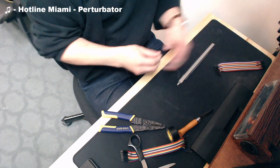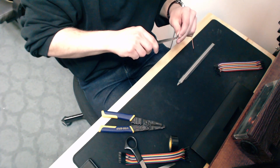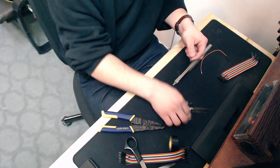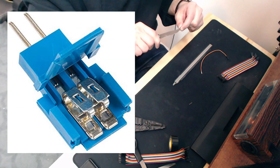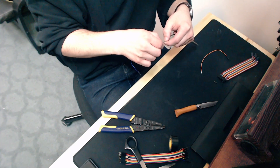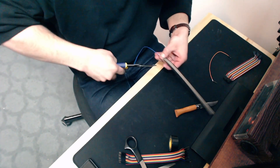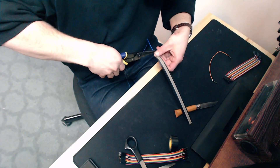I'm not going to go into too much detail on the wiring because everything I did was basically straight out of Serenny's guide, which I will link to in the description. I will talk though about how I connected the wires to the FSRs. If you buy these longer FSRs they only come with solder tabs. Serenny uses little clips — that's probably what I would recommend — but I had DuPont connectors, so I took off the plastic end and crimped the connector onto the solder tab with a pair of pliers. I've tried soldering onto these tabs before but it's really easy to melt the plastic and have the tabs fall out, so crimping DuPont cables works, but I would recommend getting those clincher connectors from Serenny's guide.